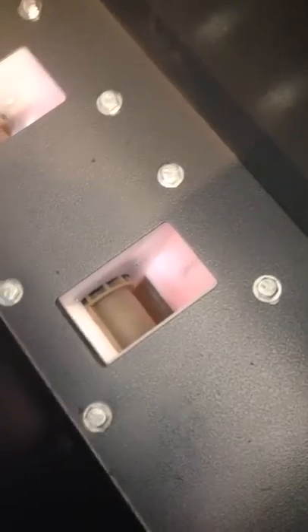When it's all the way off, you can see that this little flap right here, this solid piece, is what's going into the feeder. The way this thing works, the seed is going to come down and just sit right in here — there's a little cup in there. And as you bring that little paddle wheel in, you're going to basically agitate some seed and throw it into the funnel and then down behind the wheel. That's the whole process of this thing.